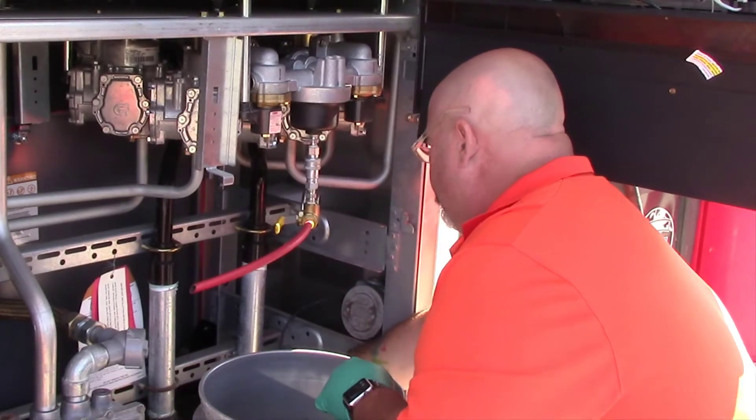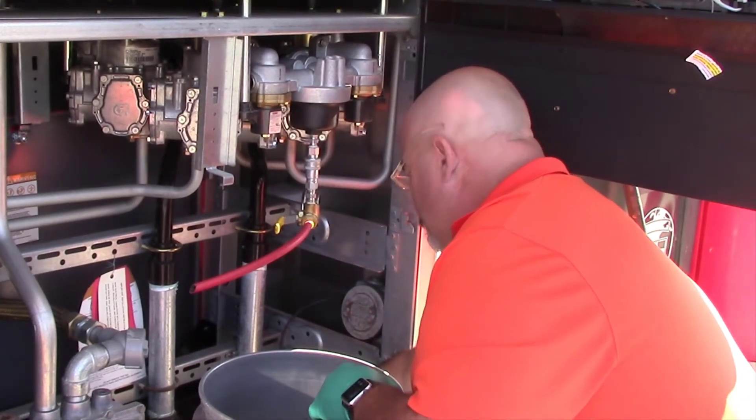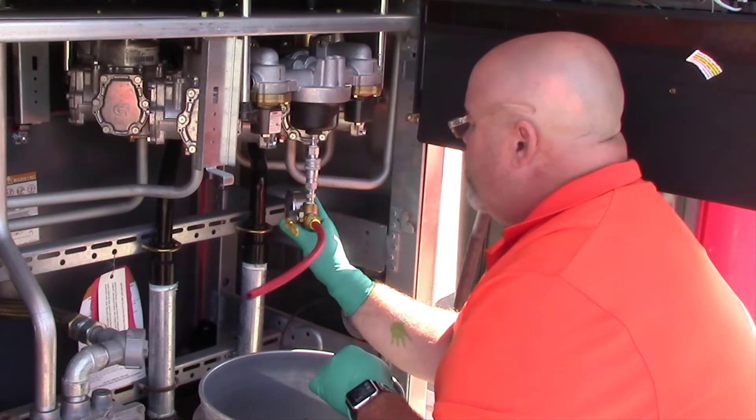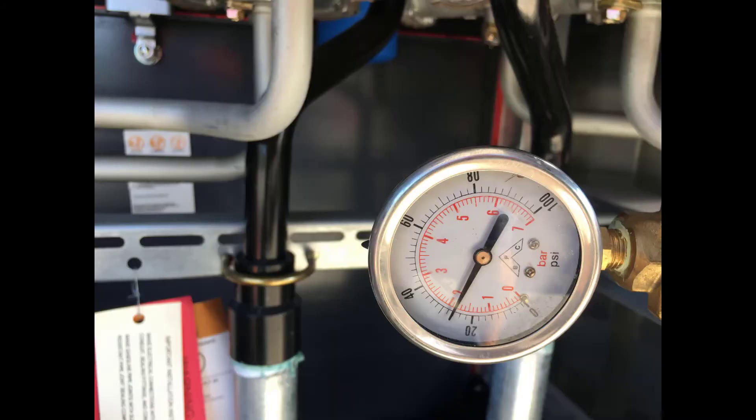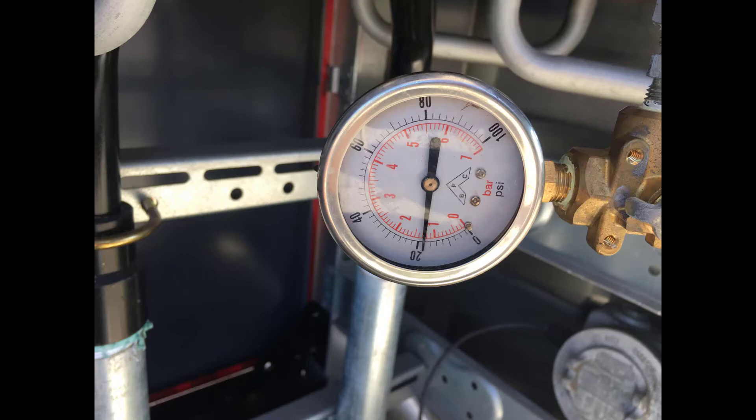After the testing rig has been tightened, reset the shear valve. Immediately, you're going to show pressure. With nobody pumping, you should see a static pressure of around 20 psi. With the handle lifted anywhere on the site, you should see about 28 psi. Remember, we operate our stores at anywhere between 28 and 42 psi.